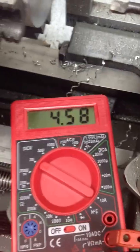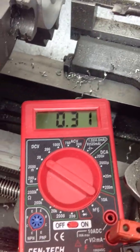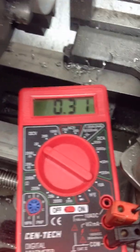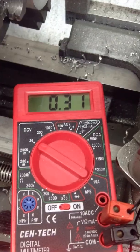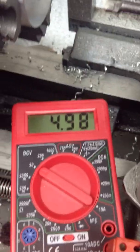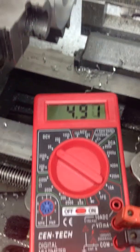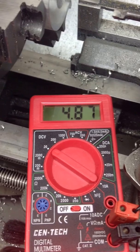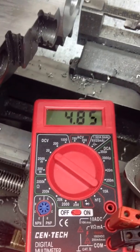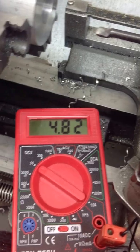And if I put the back gear in, a number of people have reported that the resistance goes way down, and you can see here it goes down to 0.3 ohms, which is well below the range of the Model 100 edge finder, but could be handled by the Model 150 and certainly the Model 210.